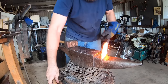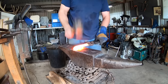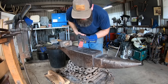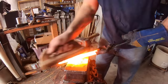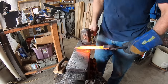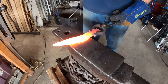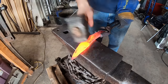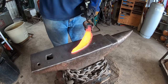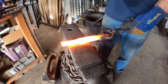I've put a link in the video to a project where I did this properly and it turned out really nice, but I struggled with this here. I went and used the forging press which stretched everything out further than I wanted at the tip. I thought I had it at this point, so I went ahead and forged out the rest of the blade — starting with the bevel and then working on the spine, which was still very thick. Working primarily on the bevel is going to stretch this blade into a banana shape, but once we forge out the spine it's really going to even things up.